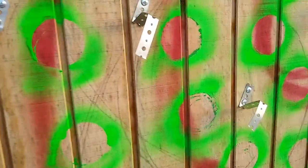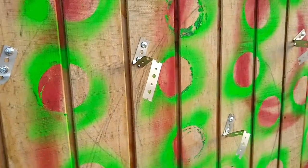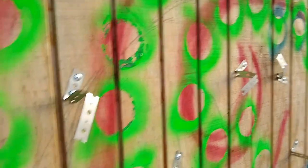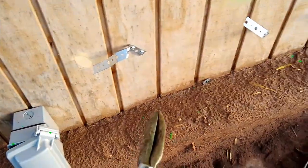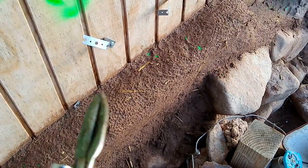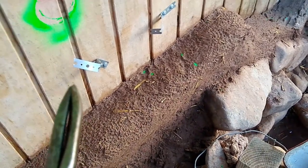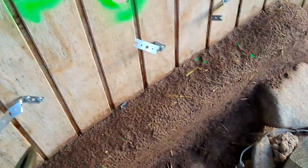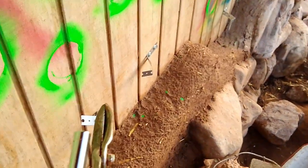And I added these plumber's tape, I don't remember what they're called, conduit hangers or HVAC hangers. Basically what this is going to do is help secure the cob to the wall. Since this cob is only 4 or 5 inches thick, it could probably stand up on its own, but with it being a square building, I wanted to give it a little extra reinforcement. So these will just get embedded in the cob, and when it dries, become rock solid, and help everything stick to the wall a little bit more.